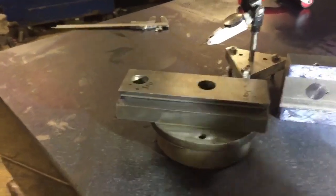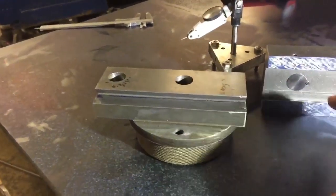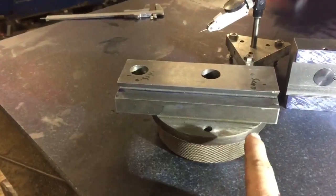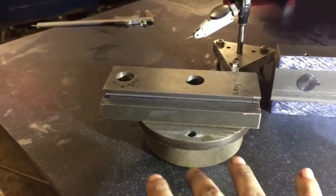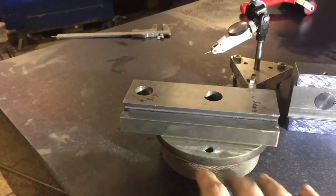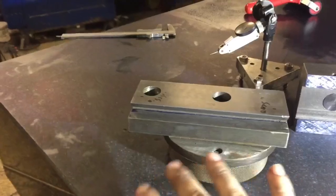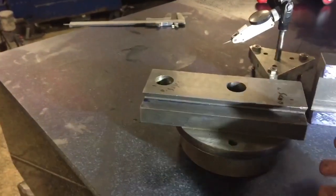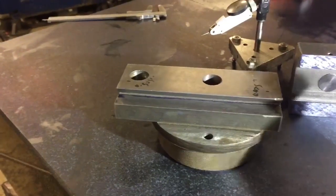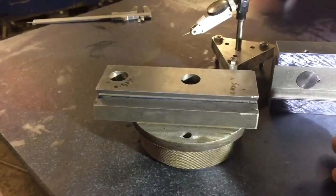The actual top slide isn't convenient to describe as a master, so I've just decided to leave it as is. The ways on here are tipping by about four thou off — I don't think it's a dent, I think it's just on the piss. So I've decided I'll match it in, get it relatively close enough that it's not moving around and not causing problems when parting off.